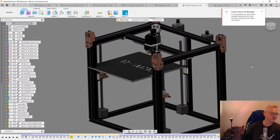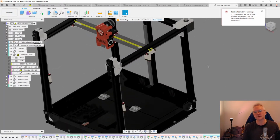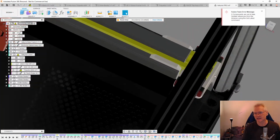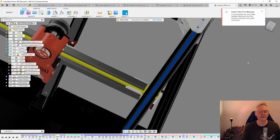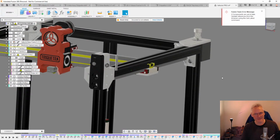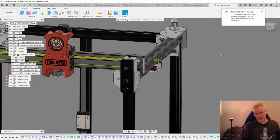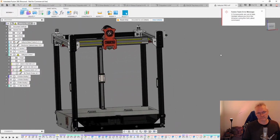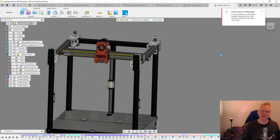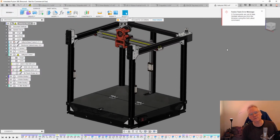3030s, yeah, it would be nice with 3030s actually. The only problem with 3030 profiles is that we might need to use MGN15 to cover the slot here, because this slot is wider on the 3030, if I remember correctly. And also my profile provider does not provide 3030s, and they might be more expensive. I think the Voron uses 2020s and the BLV MGN Cube uses 2040s. So, yeah, I don't know.